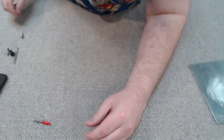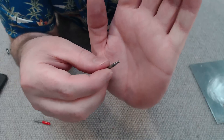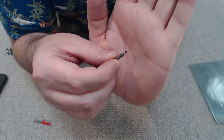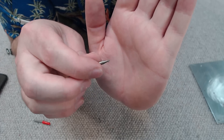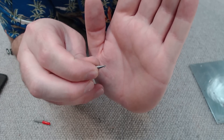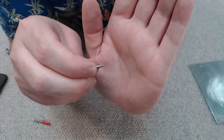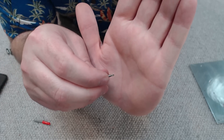Another option, which is well known, is Dremel's engraving bits. This is a ball cutter which is quite widely used — it gives a nice radius to the text that you're engraving. These generally come in HSS, whereas the V cutter I showed you was in carbide, although you can also get them in HSS.